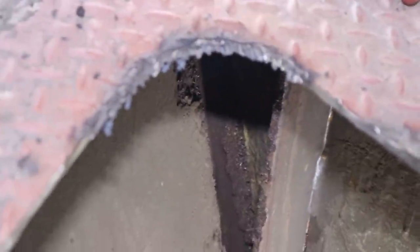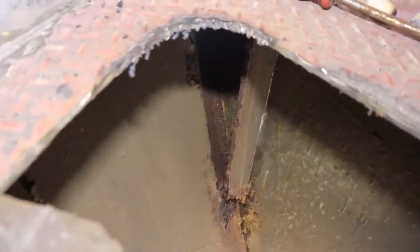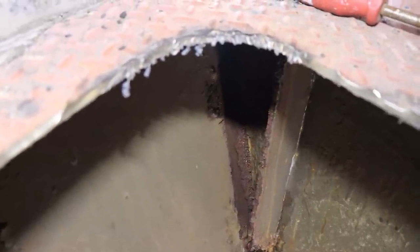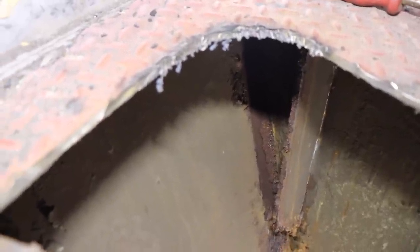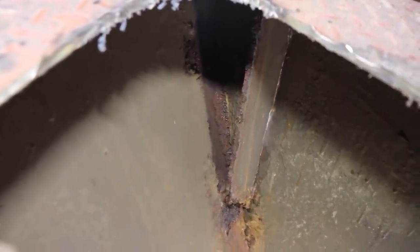So if I come back, you can see there's a vertical rib, and then that over on the side there is the side of the actual boat. And where they join, there's obviously a bit of moisture or whatever sat. The moisture can roll down if there is any, but either way, I know what's going on. You can see there's a vertical rib and then there's a patch that's not painted. That patch that's not painted is a previous repair and the repair has failed. So the good news, we can just cut that out, put a new one in, do it properly, get a double continuous weld on it, and then we're going to be awesome. We're going to be stronger than what they did, and they were in survey, so I'm pretty happy about that.